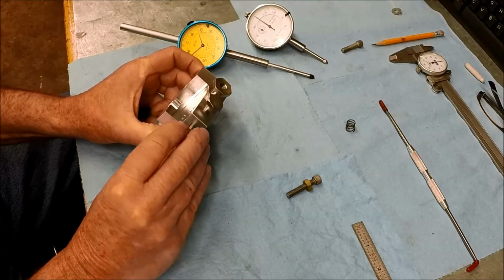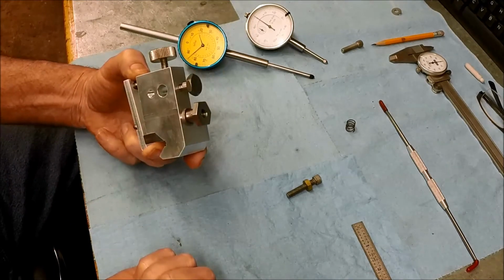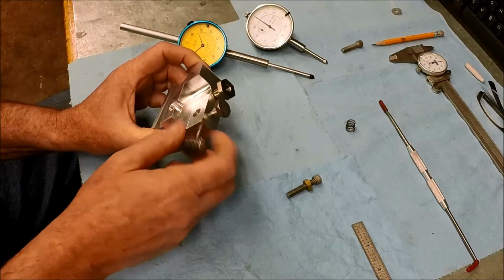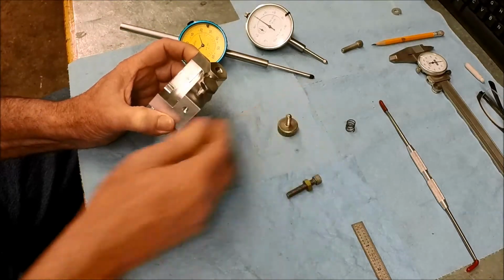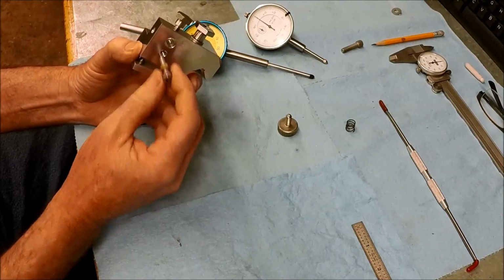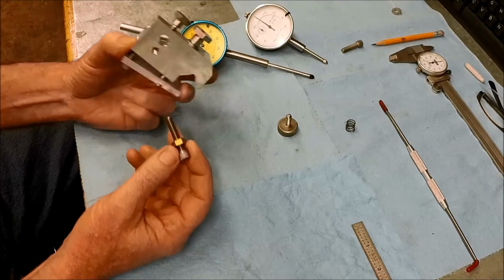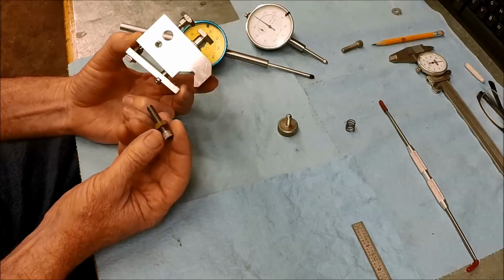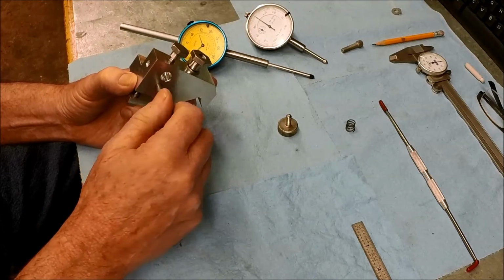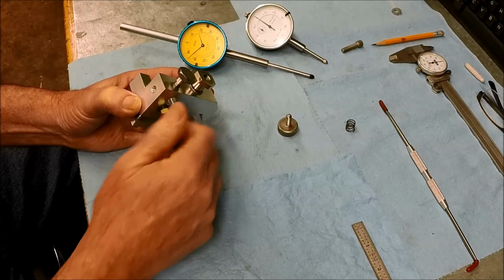Okay, so anyways, we have the option of having our thumb screw here on the back end instead of the top. And then we've got our hard stop, and it's just 1/4 20, so depending on what you're doing, you can put in whatever size bolt you need. And I've got a brass nut on there for a lock adjustment.